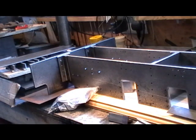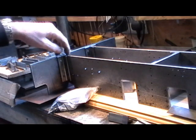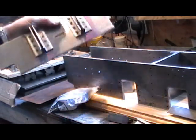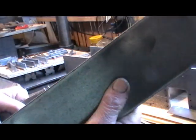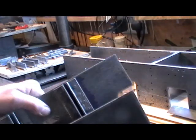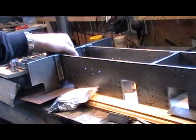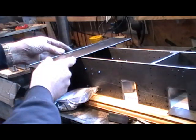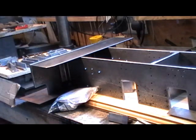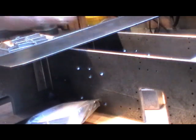Here's a little reminder - not really a tip, just something I forgot to do. When I put my angle brackets on my buffer beam, I forgot to leave a gap at the top for the thickness of the footplate that fits on top. I've had to put them back in my milling machine and mill a bit off for the footplate thickness. When that's on, you want your footplate to be level with the top of your buffer beam - don't forget to do that like I did.